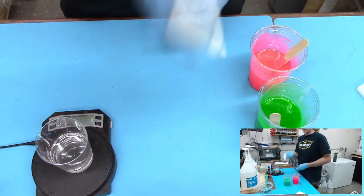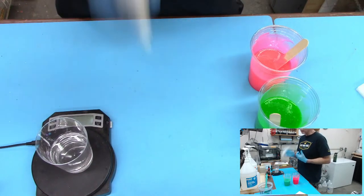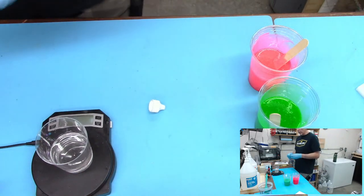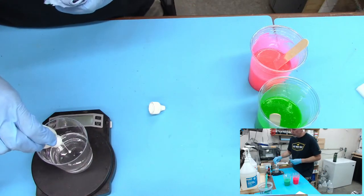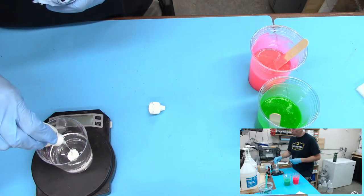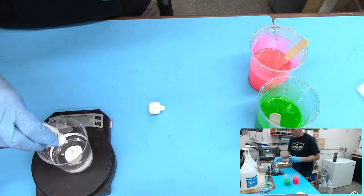And same thing goes for the white dye. This stuff is another one that's got the opaque, the big particles in it. Same with black as well. You really want to make sure that you shake. And these are for Alumilite dyes. And for Divine Pigments, they're all pigments. So you definitely want to shake all those things up. I think that's all for Alumilite's liquid dyes. I think you just need to watch out for their fluorescence, the black and the white.